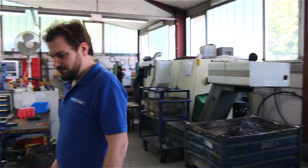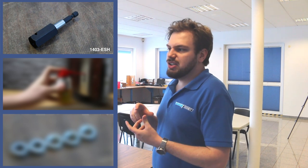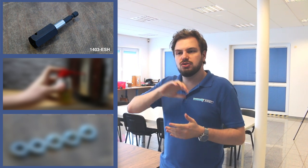We have one final question, but maybe we should go to the seminar room so you can show us some examples. What accessories are available and when are they important? You have the screwdriver adapter, which is normally used for the first screw — to pull it in very broadly and keep it aligned at a 90-degree angle to the cylinder. If you don't have a good angle, about every three degrees off from 90 degrees you lose around five percent of pulling power.